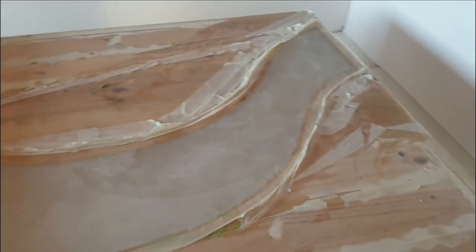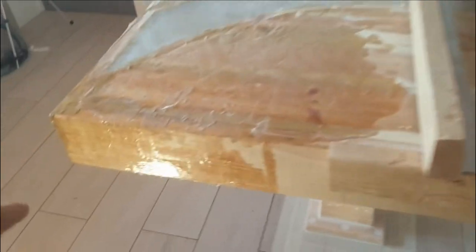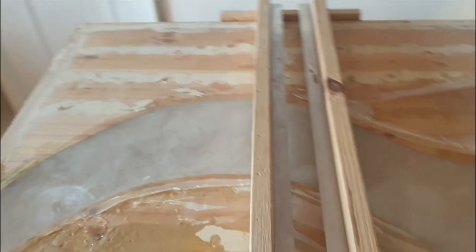And then once that's all done, we're just gonna be able to get the sander on it and take care of that. But before we start with that, what we're gonna do is go around where we've got epoxy leaks and bog fixes and stuff on the sides. And up the top here, we've got to go and sand that all nice and flush so that the sled slides nicely. Then we can make a start.